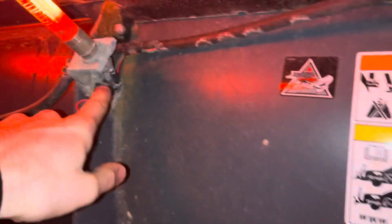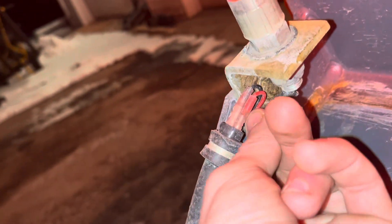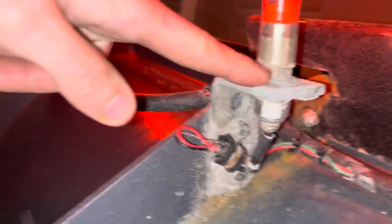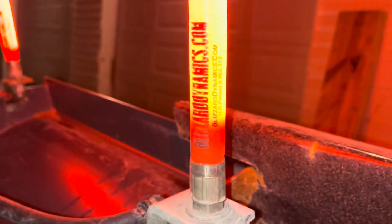I did some more clamps on this one. The first clamp — kind of an important area — is where the wire enters the light, so you don't want it hitting anything there. These are standard unistrut brackets. This one is a standard straight 90; this one I actually took a double-hole unistrut bracket and cut part of it off. And then another vibration dampening clamp here.